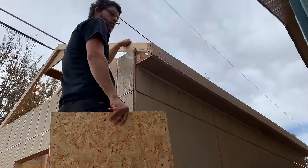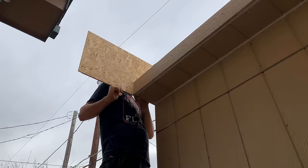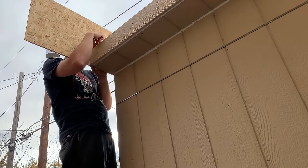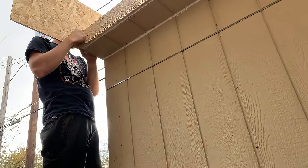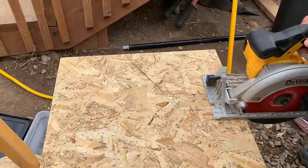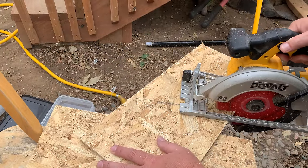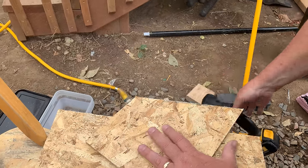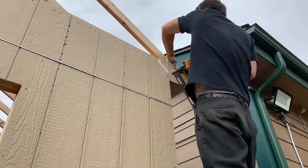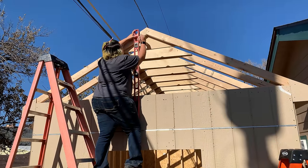With that complete, we'll turn our attention to the little bits of siding at the corner which will seal up the roof overhang. We'll just take a piece of siding, put it up in place, and trace it. It's real easy just to take a little piece of siding up there, trace it, take it down and cut it out. We want to make sure it's in the right orientation and that the correct overlap matches the siding already on the sides of the wall. We put one nail at each of the four corners and did the same at all four corners of the building.